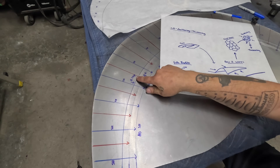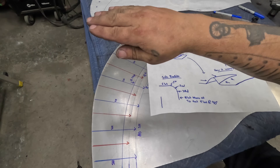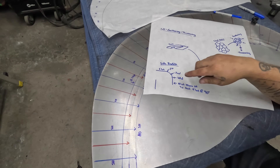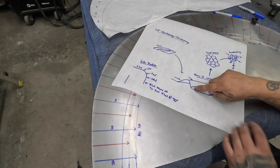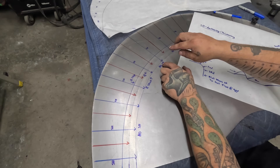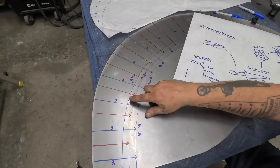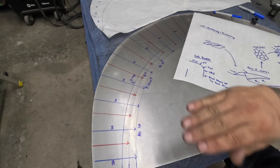On our third set, we come to the stop of our radius, labeled here with the third blue line. After that set of shrinks, it'll be almost to a 90. At this point, the end of the panel will still be up extremely high and extremely loose because there's a lot more metal that needs shrinking out at the edge. The shape of a tuck has a lot more material at the end than at the start, so once we get the three sets pulled over to achieve our radius, all remaining shrinks will stop at the end of the radius to pull that back to 90.